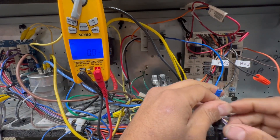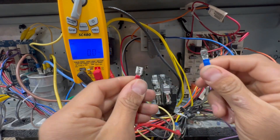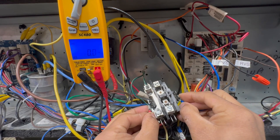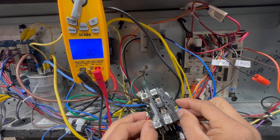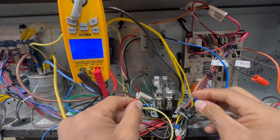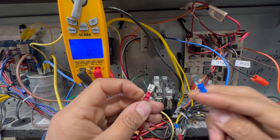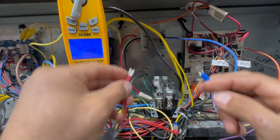A short is basically this: in an operating system, these 24 volts go to my contactor coil, right? You can see that contactor coil being engaged — that's being pushed and allowing power to go through. That coil is a load. That's okay if they go to a load; they're working together to flow current back and forth. But a short is when they both touch each other before they get to the load.